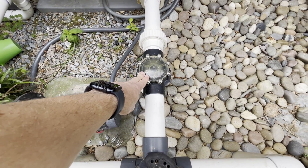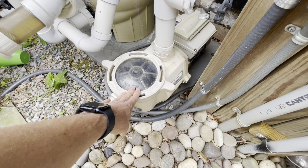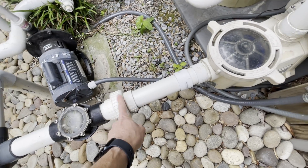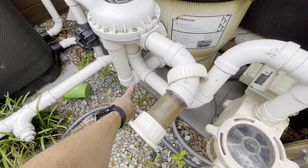One of the other safety items you might have is a backflow valve, and that comes in right before the pump. What it does is, when the pump turns off, you don't get water running back to the pool — you always want it going in one direction. That's how you can distinguish if you see pipes coming out of the ground and you're not sure if it's the return or the water coming from the skimmers. You can usually get an idea of the direction by the check valve — it's got a little flapper there, and it's going to be right before the pump. There's usually a basket in the pump as well, so you can tell that's the suction side. It's going through that check valve, then right into the pump. The pump puts it out, and that's the pressure side on the other side.